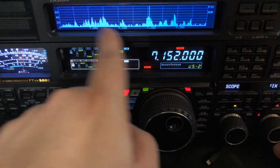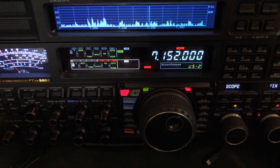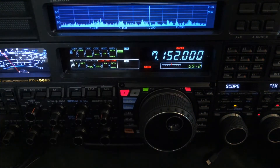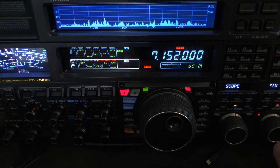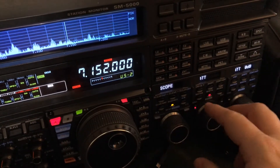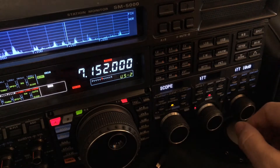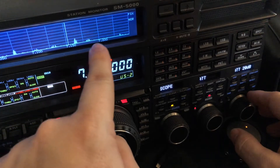I normally run it at 250K because all I'm really looking at are blips that represent signals — I'm not really into a waterfall. Even though the FTDX10 has the waterfall and 3D spectrum scope, all I really want to see are blips that represent signals. I don't even want to see the noise floor. In fixed mode, I can do attenuation — ATT. Right now there's no attenuation. Maybe I'll kick in 10 dB, or even 20 dB, to get it down to where all I see are the signal spikes.